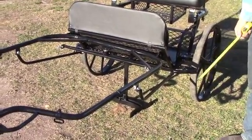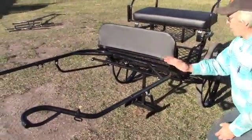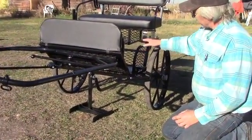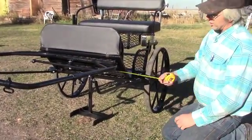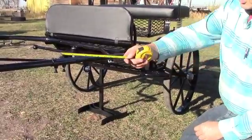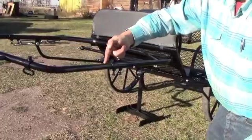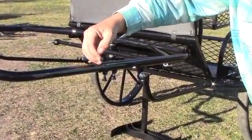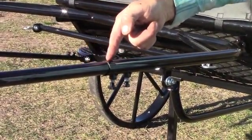Yep. Okay, when these carts arrive, there's no shafts on them at all. They're on a pallet, standing as they are, the seat is off, the shafts are off. So what you'll do on this cart to set it up for the shafts, first thing you'll do is put the tips in to where I'll have tape here and tape here with a line across. And you line up that line, poke it in as far as till the tape lines up at the edge here and the pen line lines up.